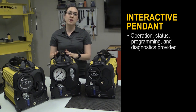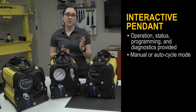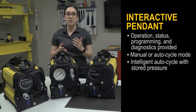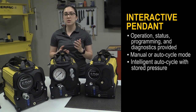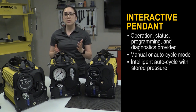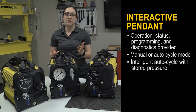For the torque wrench pump, users can operate in manual or auto-cycle mode. Our intelligent auto-cycle with auto-complete enables press and release actuation to cycle the wrench until final torque is achieved. This feature increases fastening speed without needing to go to set pressure, so retraction and the next advance begins sooner. This reduces heat buildup, damage to the pump elements, and reduces cycle time.